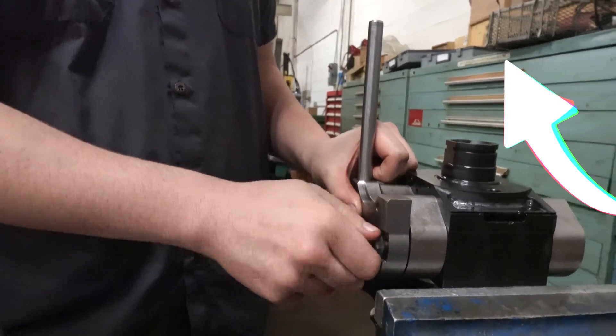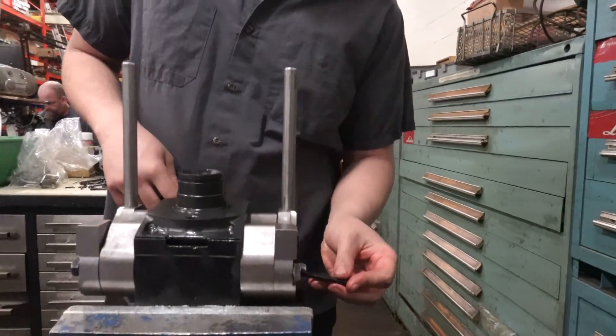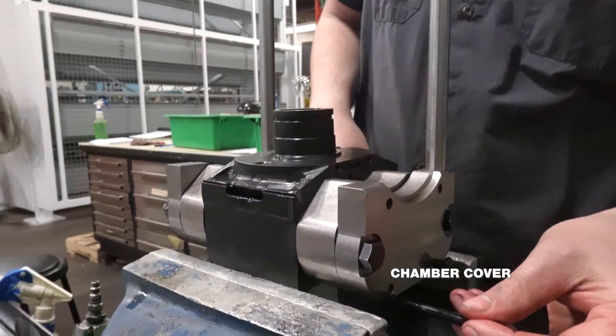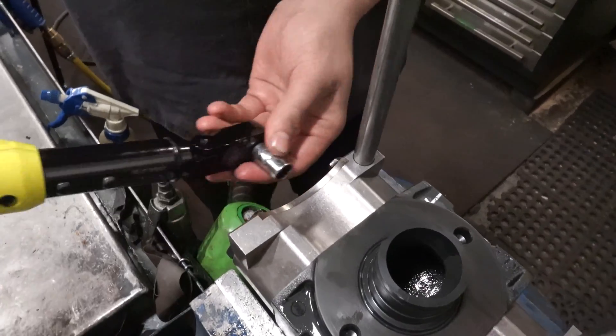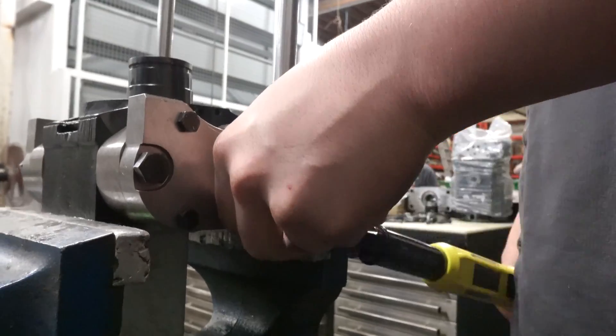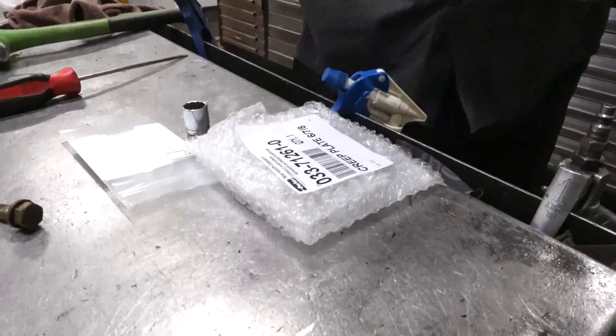In the first part of the inspection shown above, I disassembled a Parker P6 Gold Cup. I had our engineer team come out and they came to the conclusion that the creep plate and faceplate were worn out, as well as the other typical wearing parts. We always replace the seals and gaskets, so we added that to our parts list.